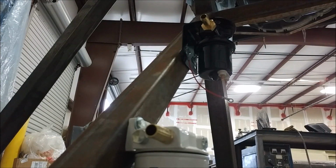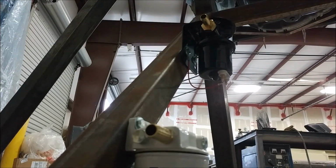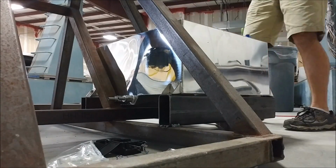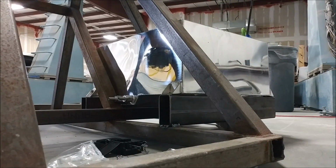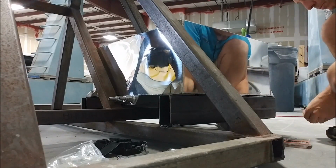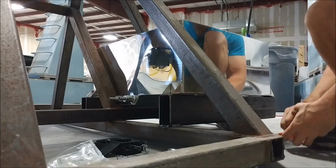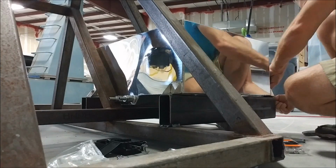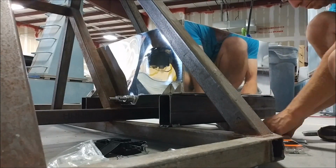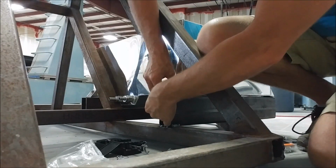And so the next thing to do on that is to hook up the hoses between those two and the tank, and then head in the direction of getting it sorted out for hooking the hoses up to the engine. And we're still waiting on the new high pressure rotary fuel pump for the engine to replace the piston powered one that's currently in there. So that's something in the works, and that'll definitely improve the horsepower and reliability of the diesel fuel delivery for the engine. And as you can see, I'm just bolting the tank into place temporarily because it's going to be coming out again, going to be putting another drain line there to remove any water that may gather in the bottom of the tank.